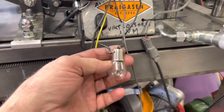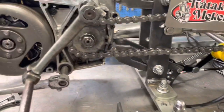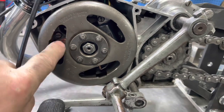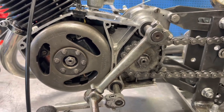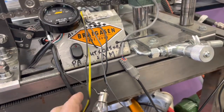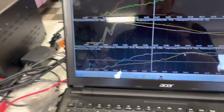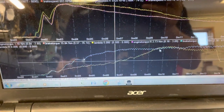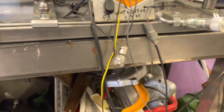I also get questions about why there is a light bulb here. That's because I take the engine speed signal from one of the light coils, and since the power is AC — Wechselstrom — I need the light bulb to damp the signal a little bit, because it goes up and down like a wave. Without the light bulb it would go bananas, so that's why it's there.